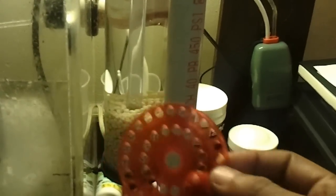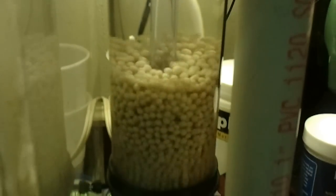By the way, it's been modified. There are actually two red discs — one that goes on top, one that goes on the bottom. I just removed the bottom one and took some Teflon tape, stuck it underneath the tube where it goes into the top red one. There's also a small white filter with smaller diameter holes. And then a little Teflon tape at the top on the inlet where that same center tube plugs into. That way you have enough distance for it to tumble the media.